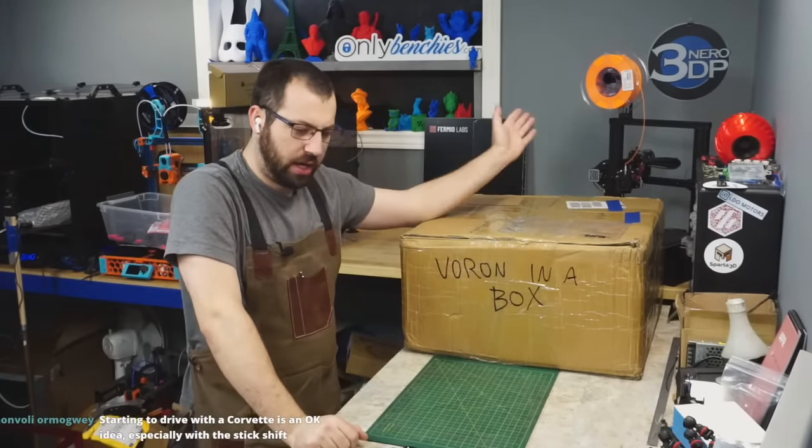We're seeing wires that are the incorrect length. We're seeing PVC wires. They're shipping with PVC wires, not silicone or the recommended PTFE wires now. They're pre-assembling some stuff, like the BAT85 diode is being soldered onto the wires backwards, so your probe ain't gonna work. Shortages of screws, shortages of components. If you're buying a kit and it says it comes with Hiwin rails, it does not come with Hiwin rails. It comes with generic Chinese rails that somebody laser engraved Hiwin on. I've bought rails from two different vendors that have Hiwin on them that they're not Hiwin. Like, they were never advertised as Hiwin. They just all come out of the same bin. So you have to be very careful with these kits.